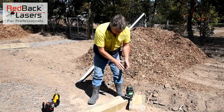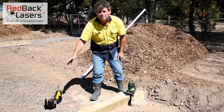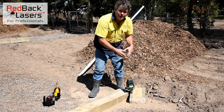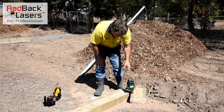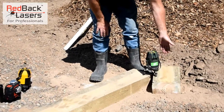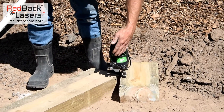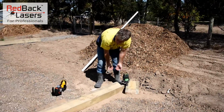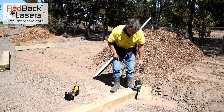Firstly, it's electronic levelling — at least three times more accurate than either of these lasers, irrelevant of brand. Electronic levelling is far more accurate than a pendulum levelling laser. If we power it on, it's going to go to the default of what I had last time. I've got four vertical lines and four horizontal, so I'm getting 360 degrees around.